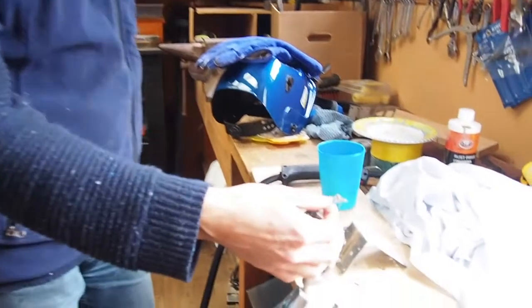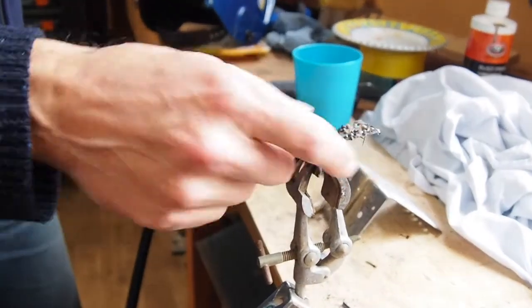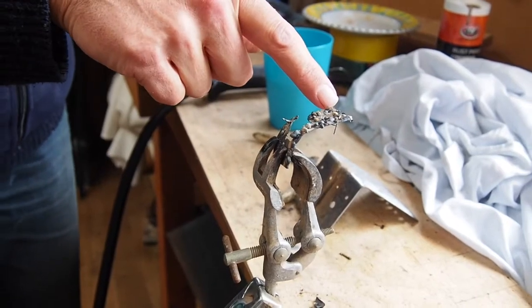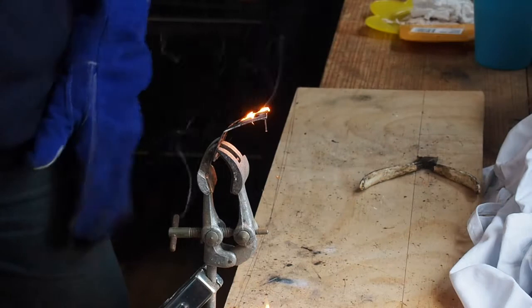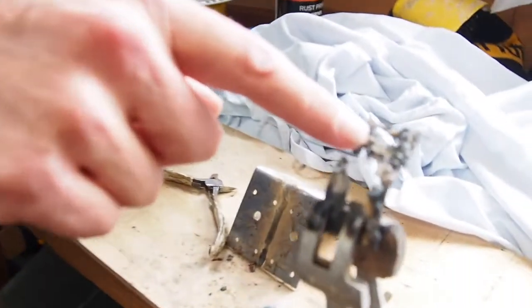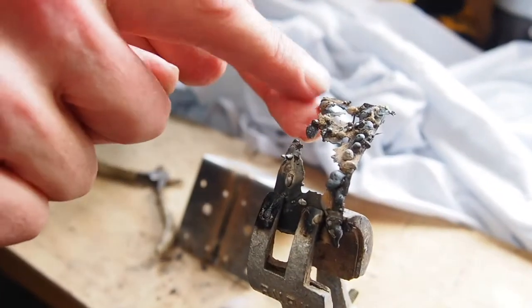I've taken essentially this piece that I cut out — it's the original Combi metal, you can see it's a bit buggered. With the MIG welder on output voltage 2, the second power setting which is stronger, I've experimented on this side and you can see it's just totally stuffed the metal up. It's gone right through — it's burned through the metal.